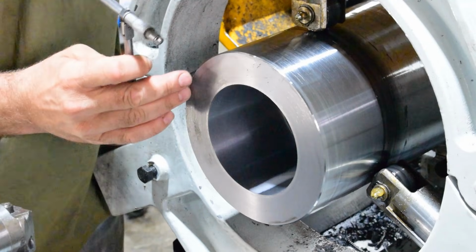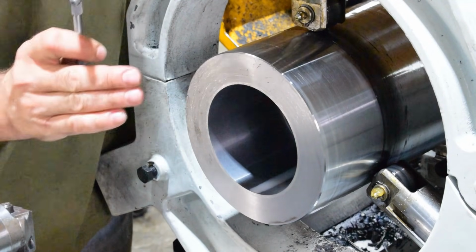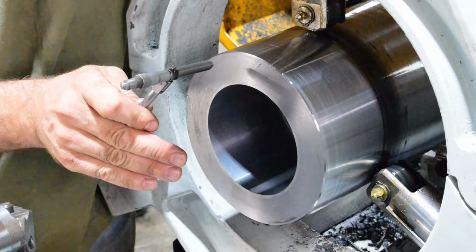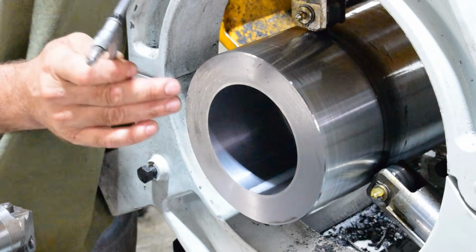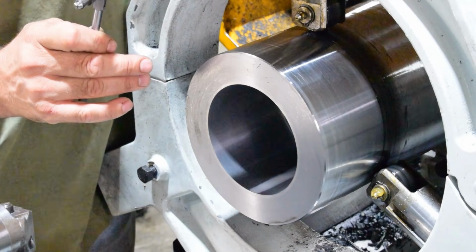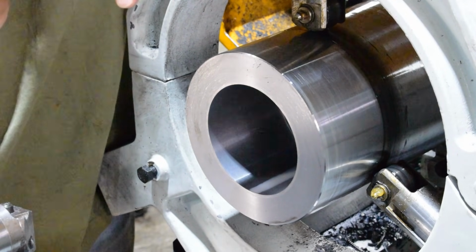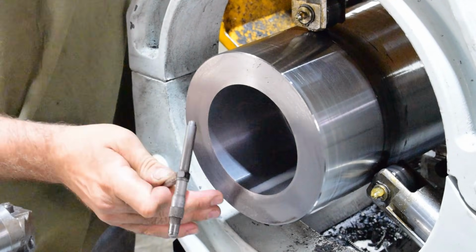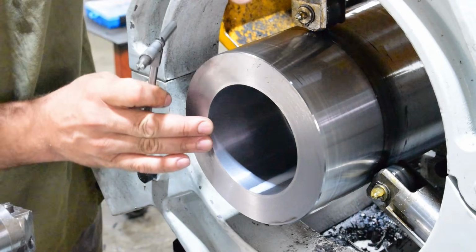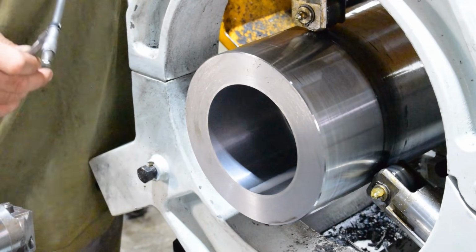You know, since I'm the one making these and making the bushings, I'm going to leave this end be, and I'll just make the other end to match 4.74. And every time I do something like this, I make notes of it in the customer file and on the invoice. So the invoice always says the bushing size when I have to make a custom bushing. So we'll just chamfer this one, and I'll flip her around, and we'll do the other end.